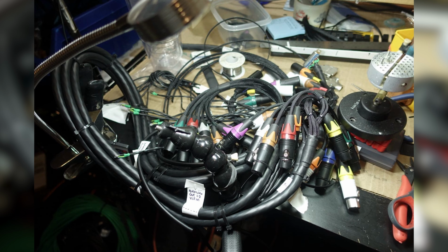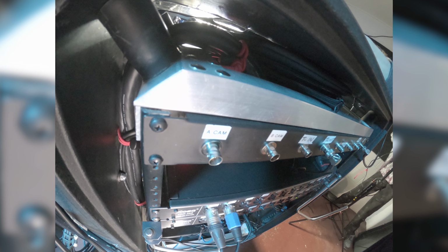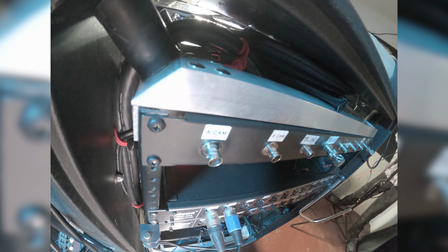And let's talk about also what kind of cable you typically used to install on this cart. Like what brand, model, all that? So for this install, we went with Mogami 8-channel analog snake cable. So it's eight individual balanced cables, and it's just got one overall jacketing on it. They also make an AES cable that's 110 ohms that's a little bit thicker. That's Mogami as well. We used some Mogami single XLRs for your 552, the two AES42 outputs. We ran those on single 110 ohm cables.